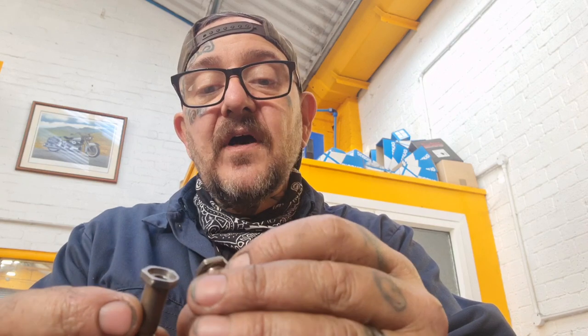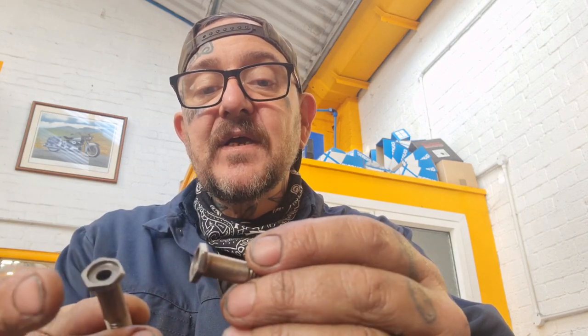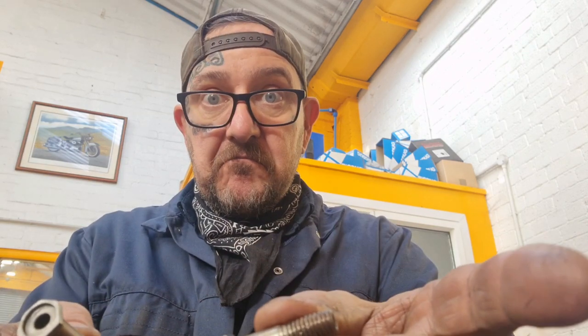I can't weld stainless that thin. I had my TIG down as low as it would go, and it's overheating and it's burning. And I think maybe you need to purge it because it's become a tube, to stop blowout inside. So that's a fail.